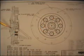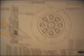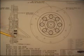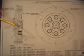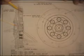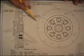The Hayes coupling pilots in the pilot bearing bore. Additional inertia was needed for damping. There's an internal bearing to support the weight of the drive shaft and coupling. A secondary drive device is provided if needed.